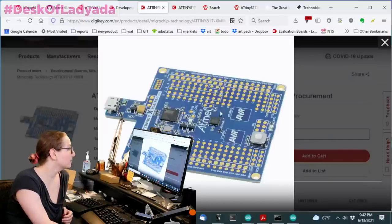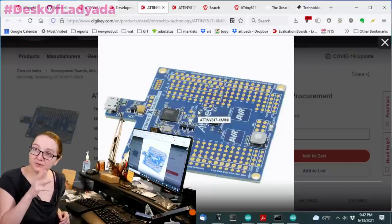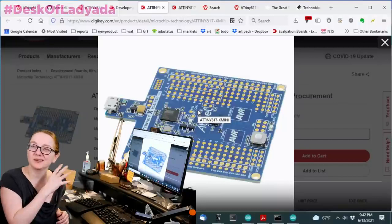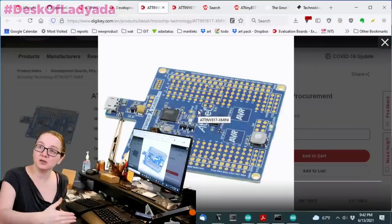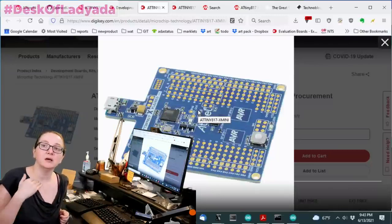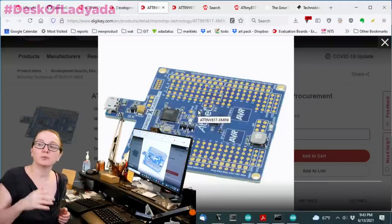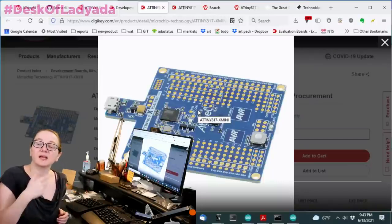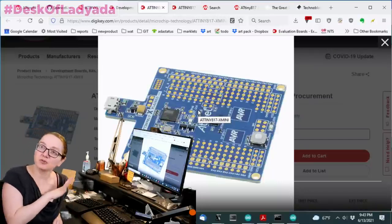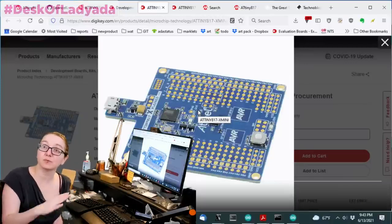And of course, people forget you can always rework this chip. You can remove this chip off of here and solder on a smaller, less flash, less RAM version if you need to. It takes a little bit of skill, but one thing I do when I'm getting near completion of my prototype, before I order PCBs, before I go into a more intense design, is order some chips, hot air this one off, and hot air my replacement on. Then I can develop with a fresh chip in the exact package, size and capabilities that I'm going to target for production.